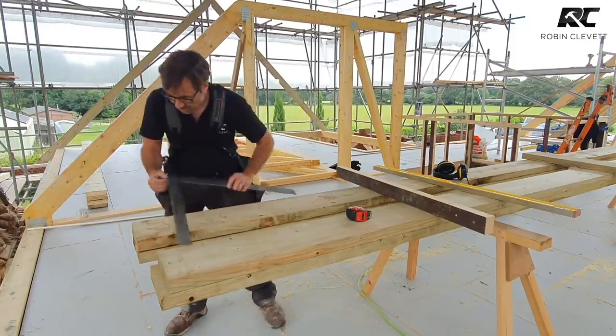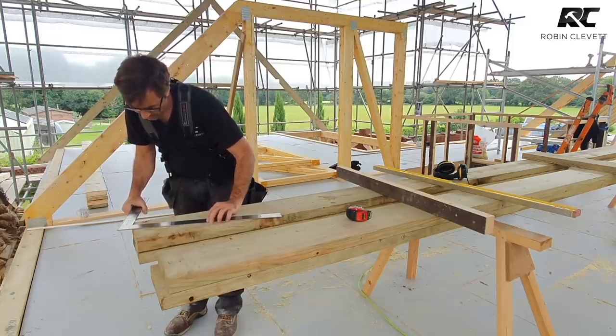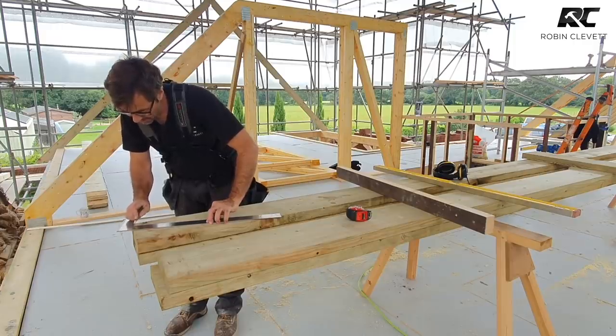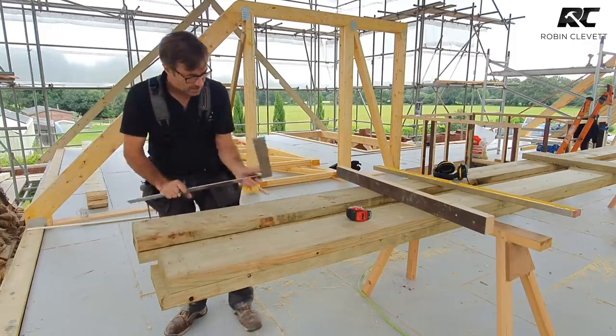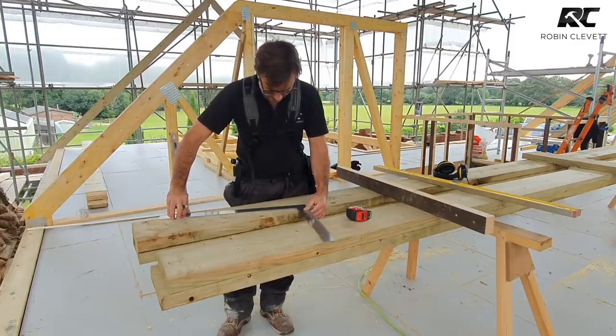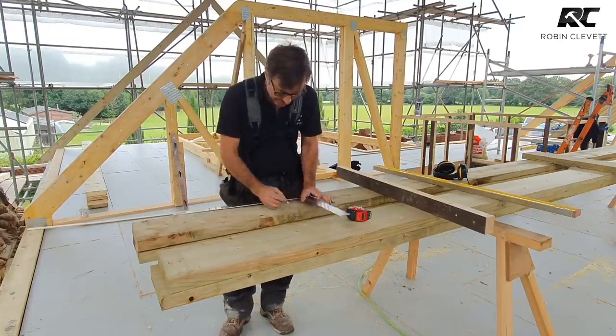We also square off these shoulders here. This is why I particularly like a framing square, because you can get a really nice marked up job. That, believe it or not, is the simplicity of a scarf joint. That is it. Now I'm obviously taking out this bit here